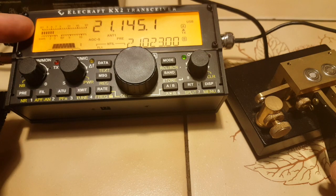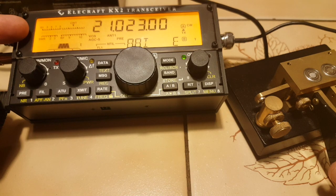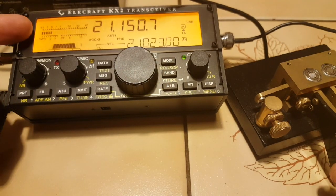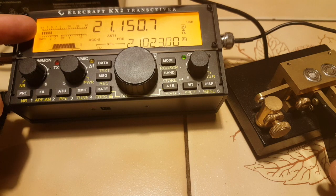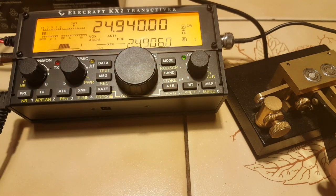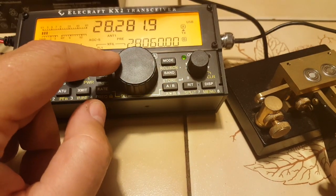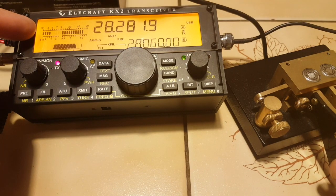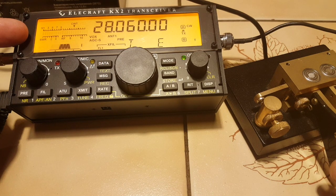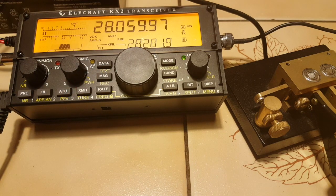15 meters: let's go to CW — about 1.5, a bit less on the USB portion, maybe 1.3. 12 meters: 1.2, 1.2, 1.1 — crazy. And the 10 meter band USB portion: about 1.7 to 1. Let's try the CW portion of the band: 2 to 1, but usable. So it's incredible — the thing actually works.